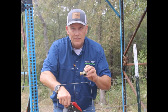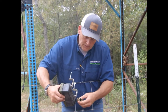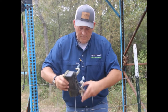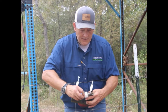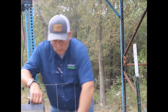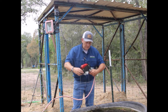That way your horses or cows cannot lick it and shut it off. Simply take this Y valve and screw it into the top of the float valve, snug like this. Then take your Freeze Miser and attach it on the end of this Y.